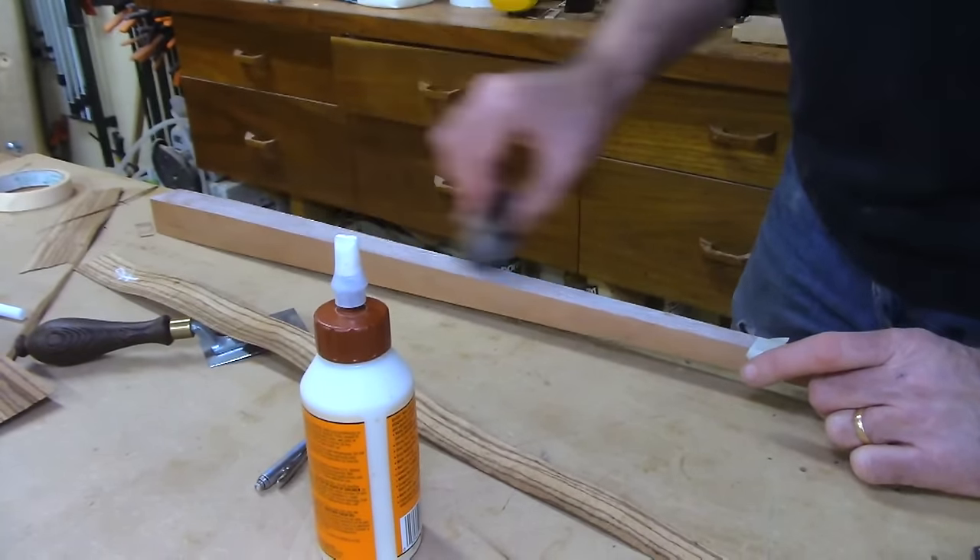Now, let me get this going. I'm going to come up three and a half. I'm going to work from the outside corner — which is true, not the tapered surfaces — and put my knife on the three and a half. I'm going to use the scalpel to just cut through that layer of veneer. I need to put my scalpel in that knife line and bring the square up to it. I'm going to score right across. Those are my two outer faces — I should be glued a little, like an eighth of an inch beyond that.